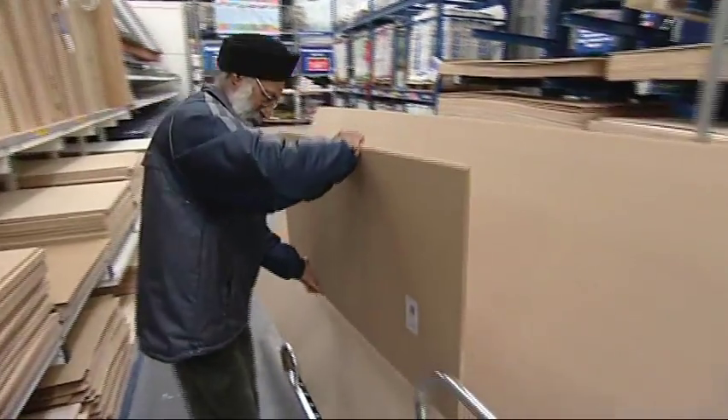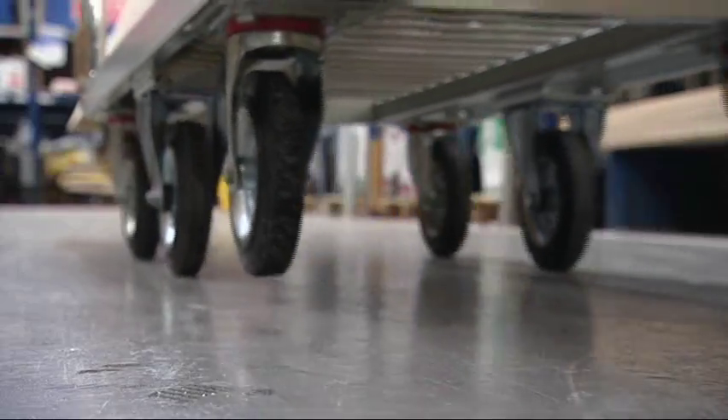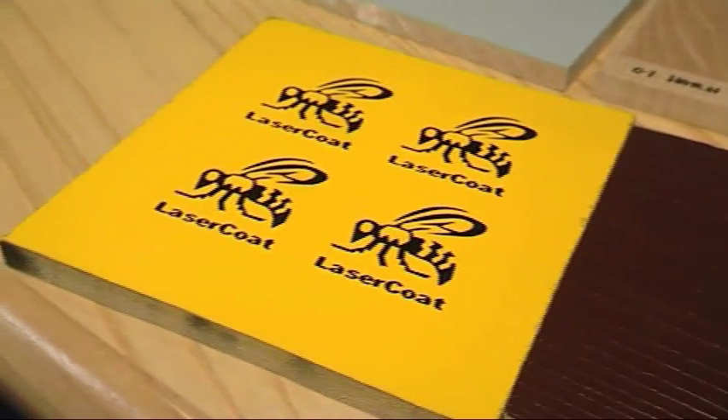The technology's moving forward. From our perspective as a company, it's very large in terms of panel products and decorative bars on our windows and doors. We have alternatives that can make the MDF look more like timber, which are foil coatings and papers, but these are additional processes and they risk damage. With this project, you're applying the decoration directly onto the timber and it can match the timber species. And then we can overpaint it, so it gives us great scope. It's easy in the manufacturing process, it looks good in the marketplace, and it performs.